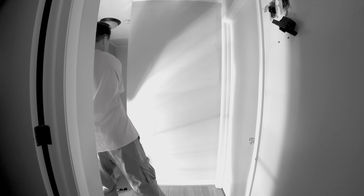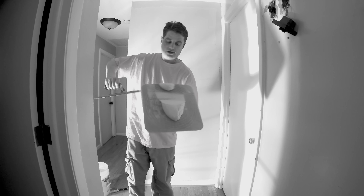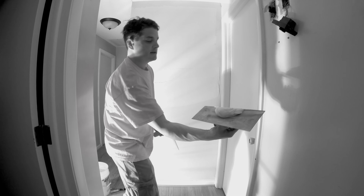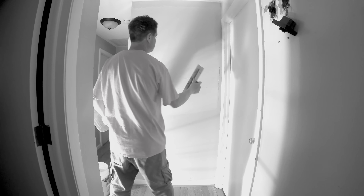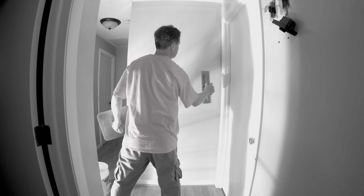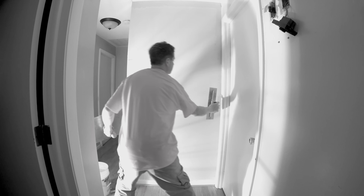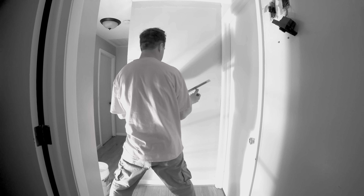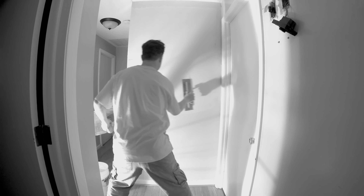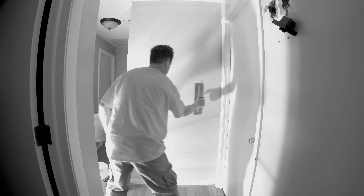Start over here. I'm really putting a lot of mud in the corners because there's a huge incline there. Clean that off, come into it, and on the last hair, come into it again. Clean that off and work that into the corner — come across. You can work it into the corner; when you take it, it only puts a little bit on, so you work that into the corner with that wrist motion and pull across.